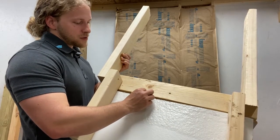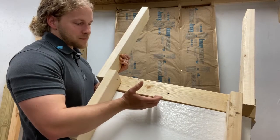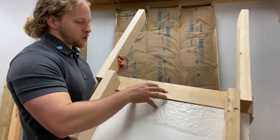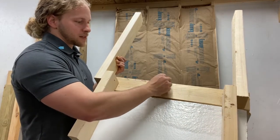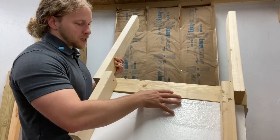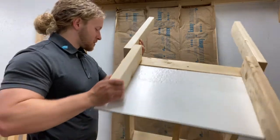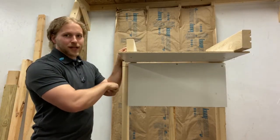Typically in the field this is about a sixteenth of an inch gap, and that's not very big, but when you add it up over lots and lots of linear feet of top plate — on this interior wall, both sides are going to leak at one sixteenth of an inch. Every 100 linear feet of top plate we get a little over a six-inch hole. Remember, top plates are everywhere, and if you have an interior wall then you have leakage on both sides of the wall.